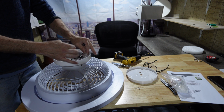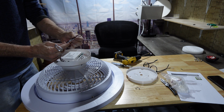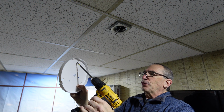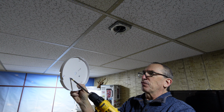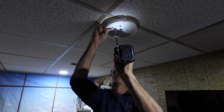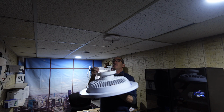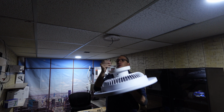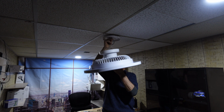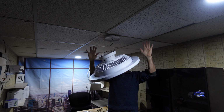You have a leash that you hang so your hands are free. You load in neutral leads. You have an option of the holes or the brackets for the 4-inch. Find the hole. Do not over tighten. With the ceiling fan in hand, find a location to put your leash in the center. Lock on so it can hold nice and securely so you can do your work.